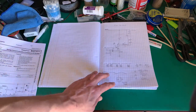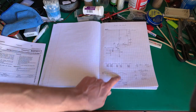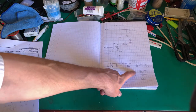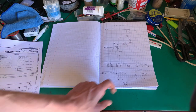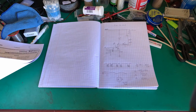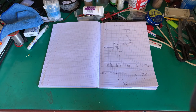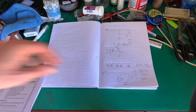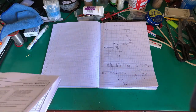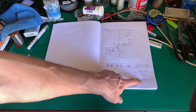So we need to change our 2 ohm resistor here, our current sense. And if we look through the data sheet, we have a bit of maths. They give us the formula: this current sense resistor is 0.5075 times the dimmer voltage divided by the current for the LED. If we plug in our numbers, 0.5075 times 3, which is when the backlight is at its brightest, divided by our 60 milliamps,